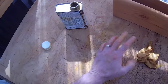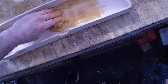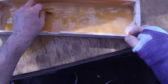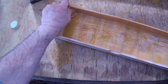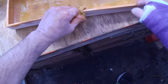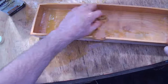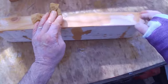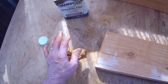The nice thing about applying this Danish oil is it's not going to get nuts on you. If you're applying Minwax stain, you have to move right along and keep a wet edge, as they say. I used to paint for a living years ago — I did all aspects of spraying: paint, polyurethane, stain, you name it. We did houses, new construction. At one point I had a team working for Northeast Painting Company, a really small company up here in upstate New York. We were doing three houses a day, new construction — three a day.